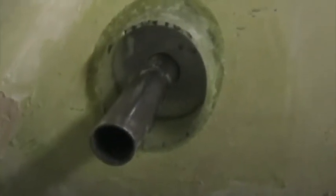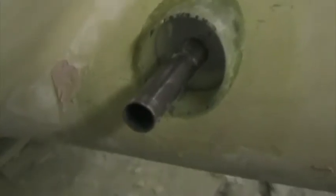I then put it in position over the actual wing pin tube, and to align it I've got two washers, 45mm washers with a 16mm hole in the center. Two of them, there's one here that you can see and then one deeper in to ensure that this thing's absolutely aligned. And once it's cured, I'll grind that off, flush with the wing, and make a little cover to fit in the front.